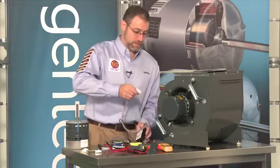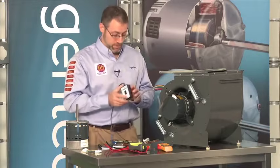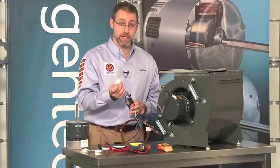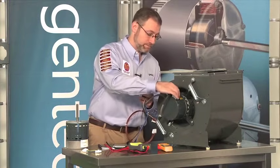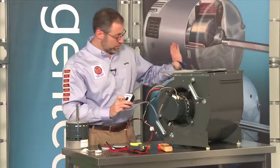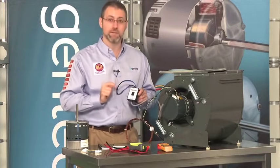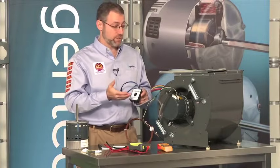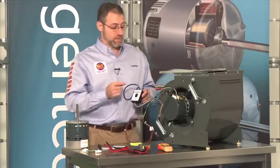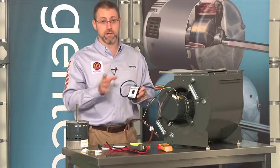Let's put the TechMate back into the motor. This is a running test, so we do need power on the motor. With the power off, plug the 5-pin connector back in — which we've already confirmed has power — then double-check that the TechMate is plugged in and we have a green light. The next step is really simple: flip the switch. We should get a go/no-go operation out of the motor from this very simple test. Now obviously if the motor does not run, there's something wrong with the motor — but let's look at another scenario first.